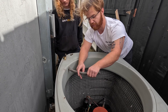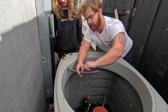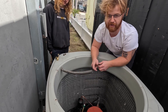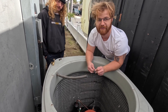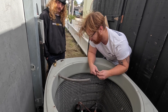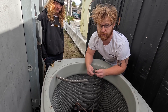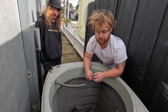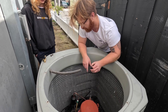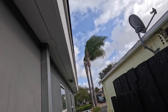What we have right now is a pinhole leak coming out the side of the pipe. When we get our brazing rod on there, if we can coat all the way around the pipe, it's essentially going to create a ghetto coupling on the pipe and that thing should not leak. This is a miss — 12 years old. Honestly, if this leak occurs again we'll probably just fix it for free for the customer and cut the whole section of pipe out and redo it. But that's what we're gonna do today.